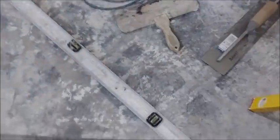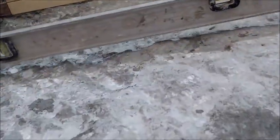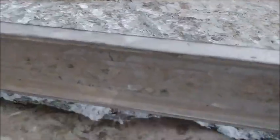So the slurry mix is going to get slopped in here first, and then once I've done that, I'm going to mix up my mortar and just slop it in here up to the point where I want it. Hold on a second. And I have this old level. You could use any straight edge really, but this old level will serve as my screed board. So once my mortar is in here, all I have to do is follow that. So up here and down there is what I'm dealing with, and all the mortar as I'm pulling this along will screed out perfectly. Well, not perfectly, I'll still have to manipulate a little bit. And I have my trowel, and I have a lot of other tools to kind of make this happen. That is the process. I can't show the process because I don't generally show my work.